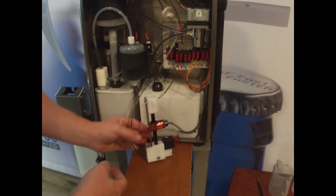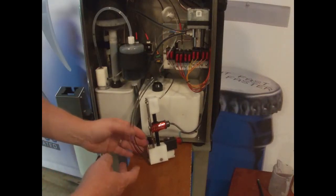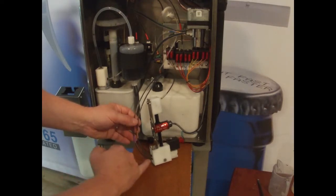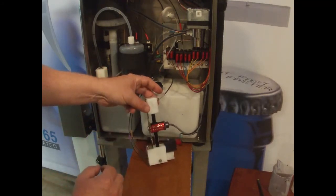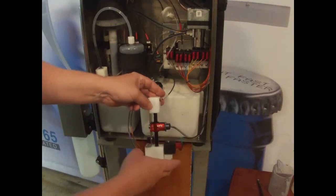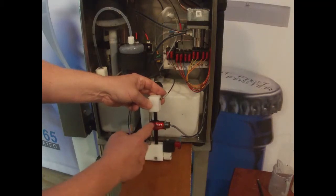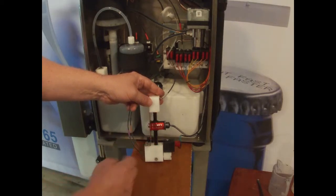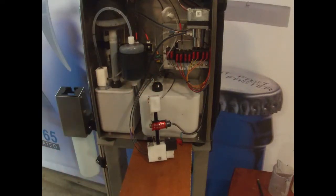And then that leaves here the viscometer. Make a note of the tube connections. So here at the bottom we have the purple or the violet, and at the top we have the brown, and then on the top here we have also the gray. Then we have the solenoid connection on the end here, and then the actual sensor that is measuring the glass tube. This here is your glass tube, and this is where we're measuring the speed of that ball bearing. So we're going to take all this out so we've got better access to it.